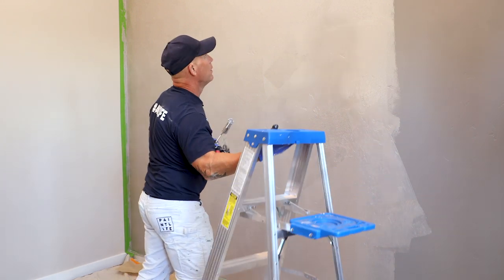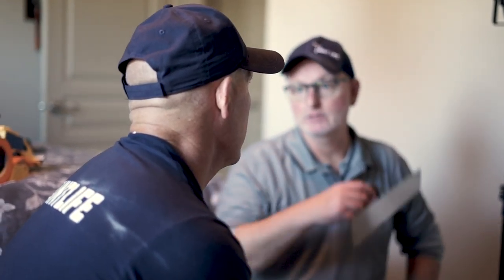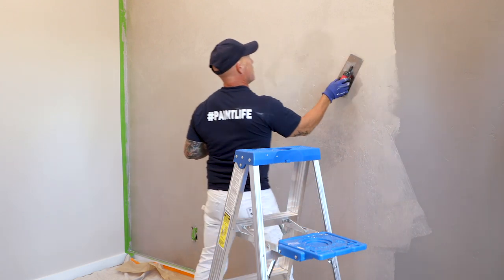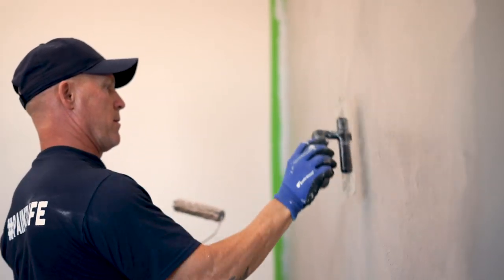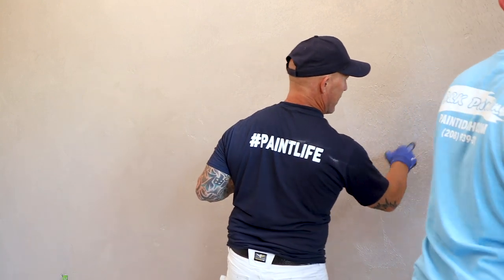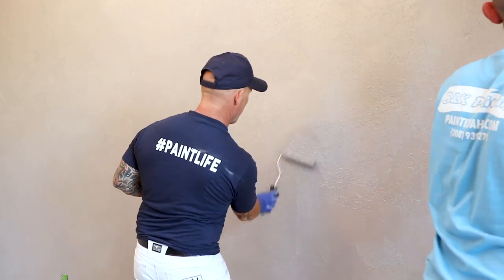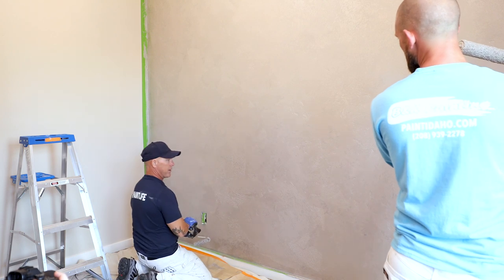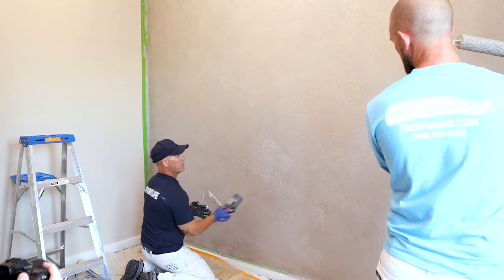When we talked to Ed from Boero Coatings, he mentioned they're starting to see a lot of this in commercial applications because it's cheaper and just as durable as commercial-grade wallpapers. Really easy to touch up, really nice deep dynamic look to the coating. With the trowel, it's really nice if you can see some of the undercoat through it — if you see maybe about 20 percent of the undercoat showing, that's about right. If you allow the nap to stipple with very little pressure, that gives it that effect.